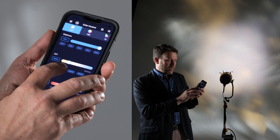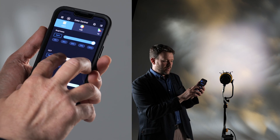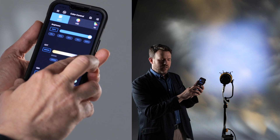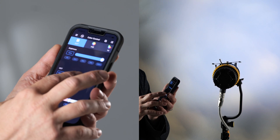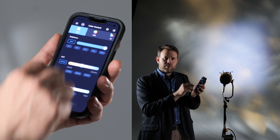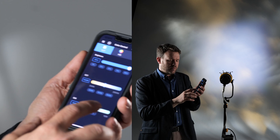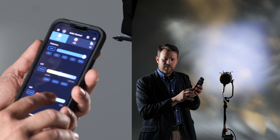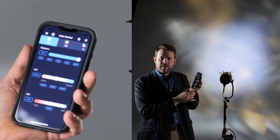This app makes it easy to manipulate all those values. In the main screen, we can use presets for color temperature and go from tungsten to perfect daylight — and all the way up to 20,000 Kelvin. Six colors gives us an accurate color point on the blackbody curve through all the color changes. We can also offset it; if you're in a space with a lot of pollution from old fluorescent tubes, you might dial in some green.